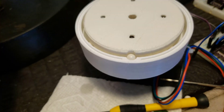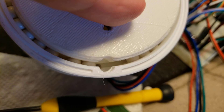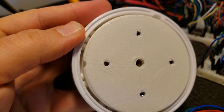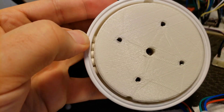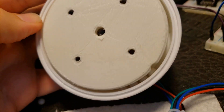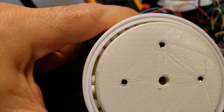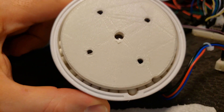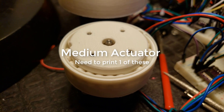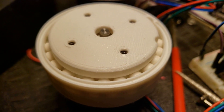Make sure you have lots of crazy glue on hand. When inserting the Airsoft BBs — I bought a pack of about a thousand — do sand that track first. I'd put two in initially and run it to make sure everything fit, so I only had two to pop out if needed, because you will end up popping those BBs out a lot and it's a slow, painful process. Once everything is dialed in, those BBs should almost roll around with no real friction.